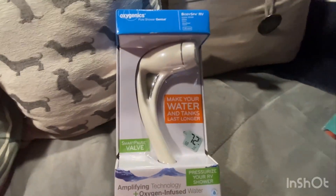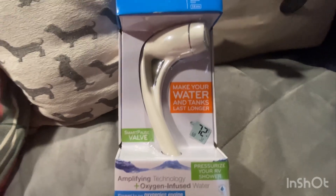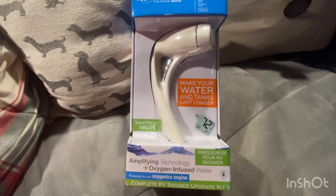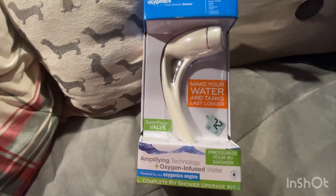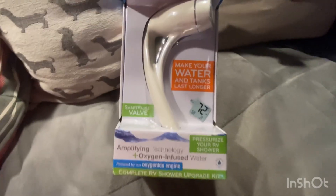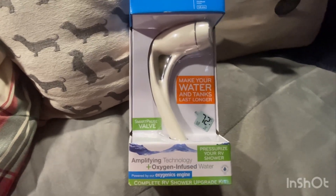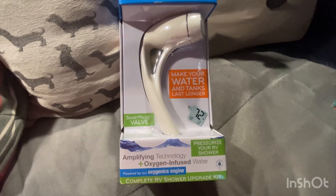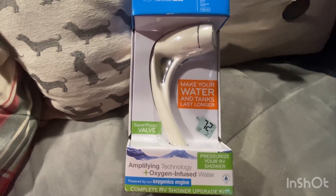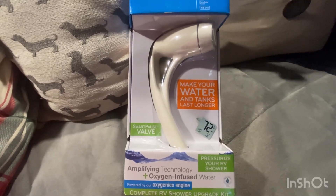I had bought this shower head a long time ago and just never felt the need to install it. My shower is not getting really great pressure, and I looked online and it said it could just be that your shower head is clogged up with minerals from hard water. I thought, this is above my pay grade, but we're gonna attempt to do this — replace my shower head and hopefully that'll take care of the problem. The other solution would be to replace my pump, but if my pump was bad I would assume the pressure would be bad in all the sinks, not just my shower. So that's what leads me to believe something's clogging up just the shower head.